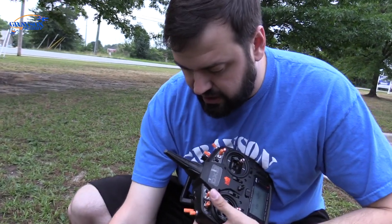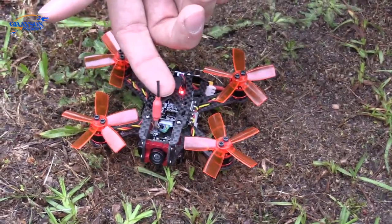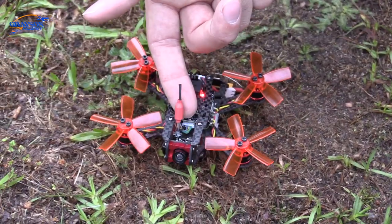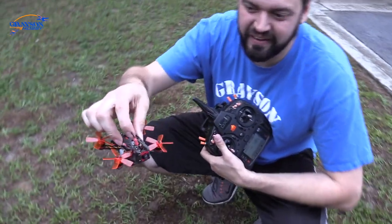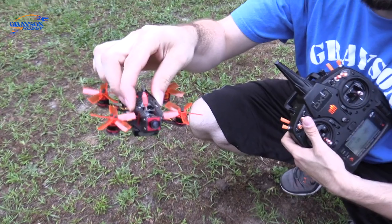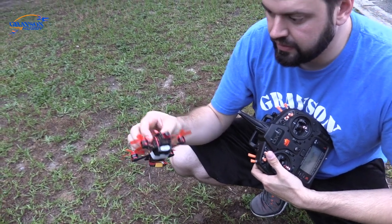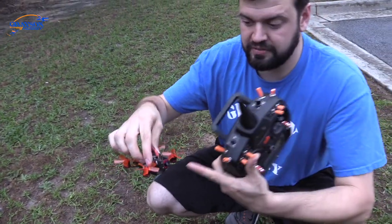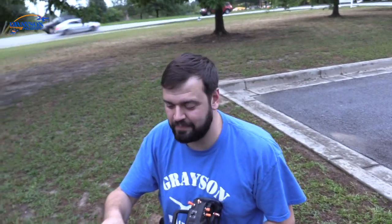The other mod I've done is a standard dipole antenna — I took an old rubber ducky that came with some goggles, sliced the top off, and soldered it on. My original antenna did get broken by somebody. Now I've got a dipole on it and the video quality is pretty good — a little more breakup here and there, but if you've got a good pair of goggles you'll be fine. You can blow out the camera if you do it wrong, so find somebody that knows how to do it.